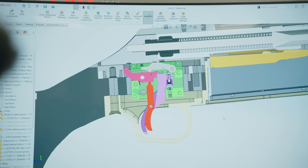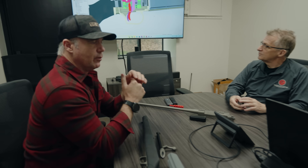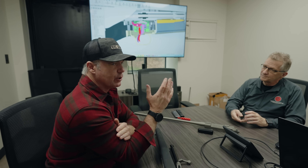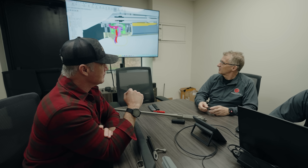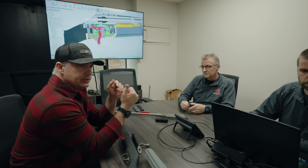It's not like a long blade trigger you'd find on a Savage 110 or on a pistol. It's a very small take-up. The reason for this is it's a hunting gun and we want something that's ultimately safe — you basically have two safeties on the gun. One of the things it allows you to do is go down to a very light trigger pull, because that lever is the sear connector. As it slides out from underneath, if it's engaged, it makes it extremely safe if the gun gets jarred. Once you move that out of the way, you can have a light trigger pull.